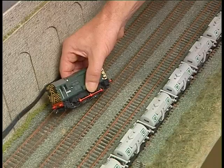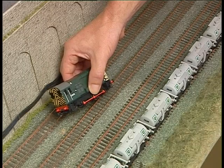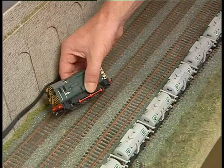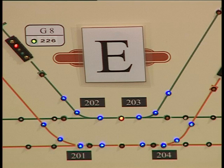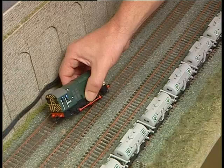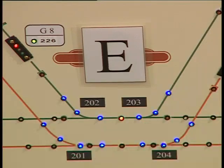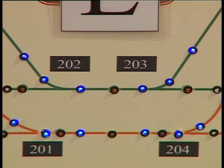Here's a practical demonstration of how the BDL-168 works. This device measures track circuit occupancy around the layout. I have an engine here that isn't running, but if I put it on the track, you'll notice that the lights come on — the LEDs at the far end of the room are illuminated. When I take it off, they go off. On again. And finally, if I take it off, the occupancy goes out. For me it's really important for the computer and the signal control systems, who both look for occupancy as a fundamental control mechanism for making sure the trains operate in a safe manner.